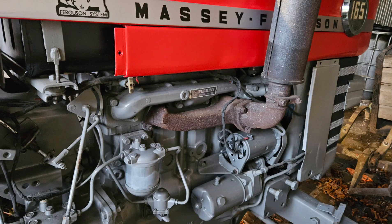As you can see from the video, we've had it running. We've got the radiator back into it today. Got it bled out. Got the diesel system bled out. Got the batteries and stuff into it. Got the electric connected up, starter connected up. Got the booster pack on it. Got a nice hot blowtorch, threw a nice bit of warm air down into the intake system. And yeah, it started very, very easily. Thank God.